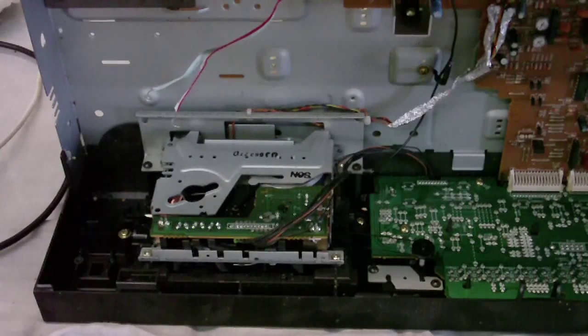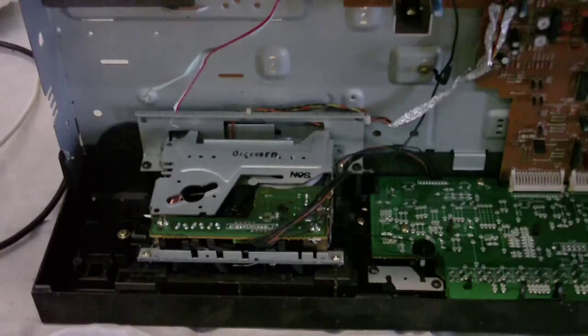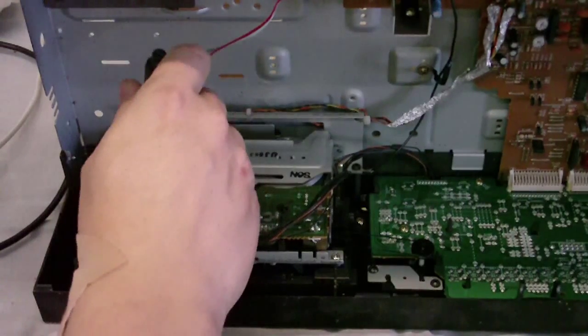I hope my sound isn't so clipped this time. As you probably know, I don't use the camera's microphone to record. I use one of my other tape recorders. I'm currently recording the sound on a cassette recorder, and I had the level turned up too much, and also had the bias all the way down, so I've turned the bias up and I've turned the record level down, so it shouldn't be so clipped this time.